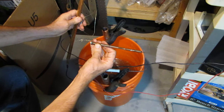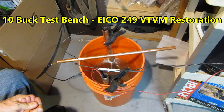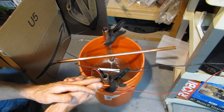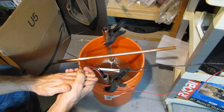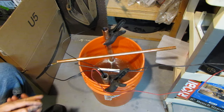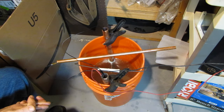Those of you who have been watching for a while will remember when I did the Ico VTVM — you can go back and find that video. The chassis had received a lot of battery damage; the battery had leaked and corroded all of the plating on the chassis. I glass beaded that and did the same process, but instead of using copper I used some zinc sheet and replated the chassis in zinc. It came out beautifully when it was done.